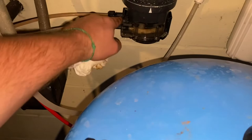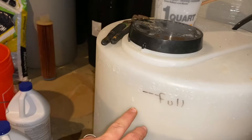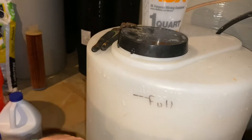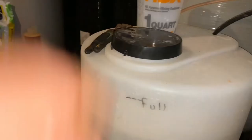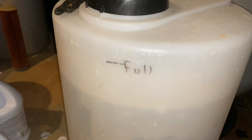So I'm going to keep an eye on it. If the thing leaks again, it's safe to assume that the valve in that piece up there went bad. If that's the case, we'll post another video on how to replace that. Another way to know if that's leaking is to keep an eye on your tank — if it goes up at all, you know that water is being pushed through and back in. So if that happens, I know that's my issue. We'll keep an eye on it. And that is how you do the tube part. If we need to do that little valve up top, we'll do that in another video. If anyone has any questions, comments, or concerns, please leave them in the comments below. Hit like, subscribe, and all that stuff. We'll see you later.